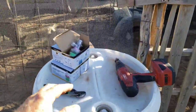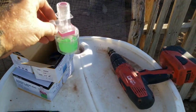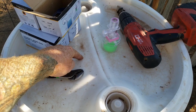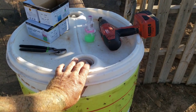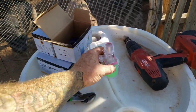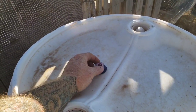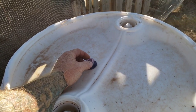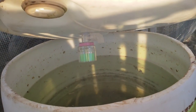Here's my first barrel. I've got a goat and two male pigs in here — some boars. So we're just going to drill a hole in the top of the lid here. This is a cut lid — I normally just fill this with a hose, but I can just leave it set there, drill a hole that this will slide up through. So I can just attach a hose or PVC pipe connection. This is a standard three-quarter, and then underneath you can see there's the float valve.